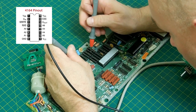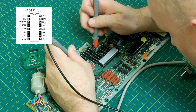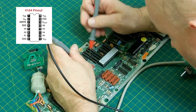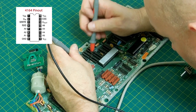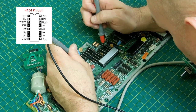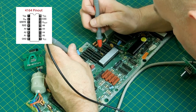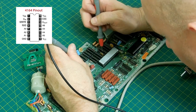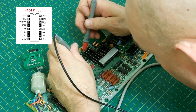The same goes for pins 3, 4, 5, 6, 7, 8, and then on the other side 16, 15, 14, 13, 12, 11, 10, and 9. The only pins that don't transfer — that aren't connected to each socket — are pin 2, the data in, and pin 14, the data out. Those are individual lines that go to the CPU. You can test those by chasing the trace on the back and checking for continuity there. Normally the ones that break are the address pins — those are the ones I always seem to have issues with.